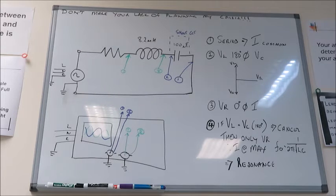So if you look at the circuit, and you can work it out for yourself, looking at the purple one, you'll see that 1 and 2 are connected across the capacitor, and you will notice that 1 is the hot wire and 2 is the earth, and that also on the right hand side the capacitor is connected to earth. So we end up shorting out that capacitor. You can try multiple combinations of connections, and you will always short out a component.